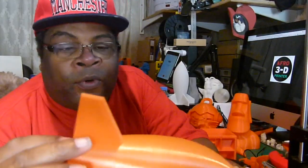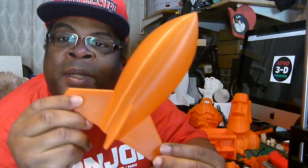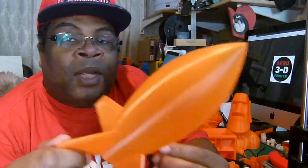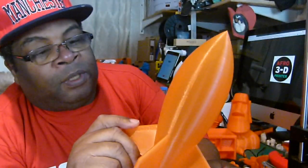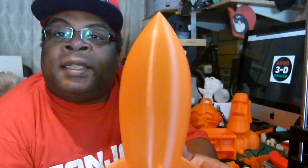If you're looking for a quality British manufactured filament, I'd say give them a go. Really good quality filament. It prints really easily. It flows out the nozzle easily. I printed this at about 190, at a speed of about 60 or 70. And as you can see, it came up.